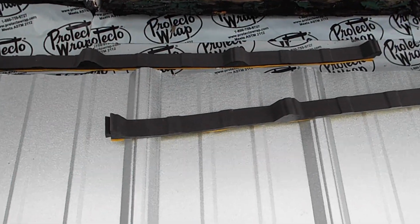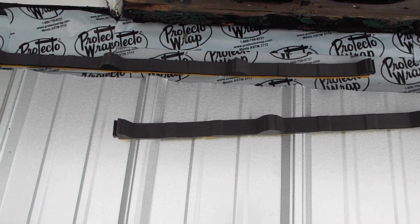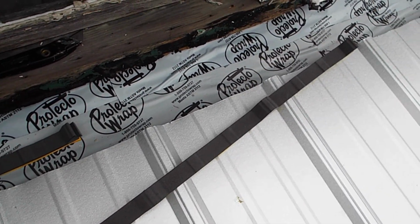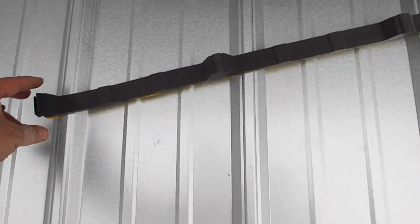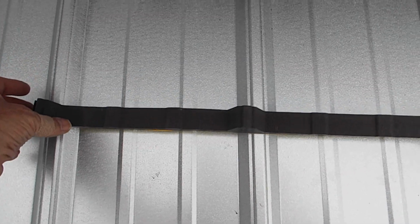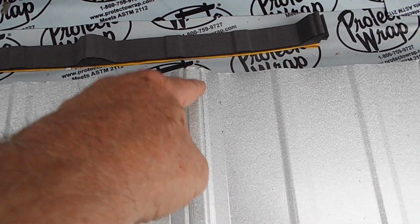Now I asked the roofers to take that sealing foam and seal the end of the roof. Of course they didn't, and I had to make two trips down to their house to get the foam, and now I've got to reach under about 3 to 4 inches and set it on the first nailer and tuck it up in. And I discovered that I can't do it with the built-in stickum, so I cut it and leave the backing on, because that goes all the way down to the end of the roof.